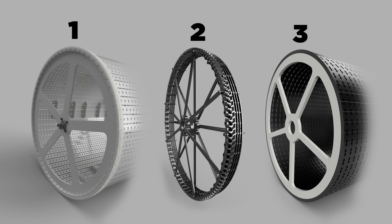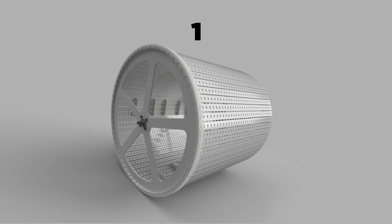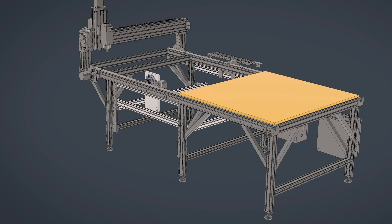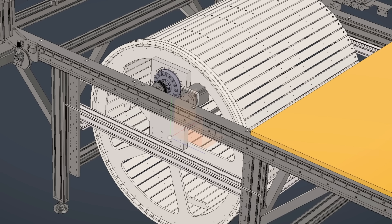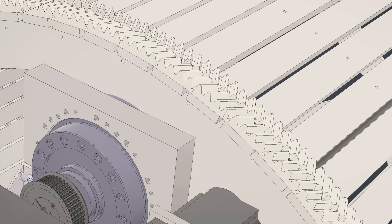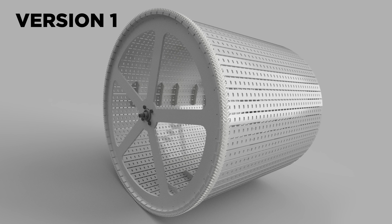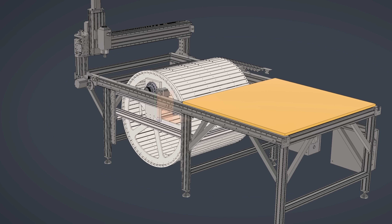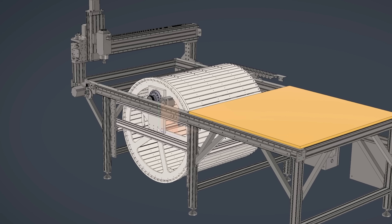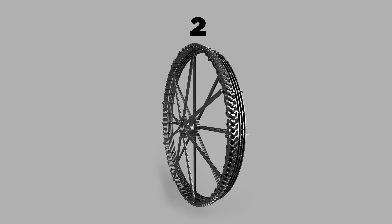But what is actually the difference between these three designs? Version 1 is machined on a rotary CNC machine. The rotary CNC will cut all the programming holes with CNC accuracy and it will also cut the big double helical gear in the same setup. But there's a drawback — this machining task is pretty involved. An experienced professional with a great machine could absolutely get the job done, but I wanted to see if there are simpler ways, so I came up with a very experimental idea: version 2.